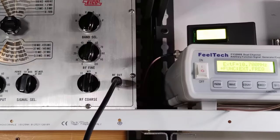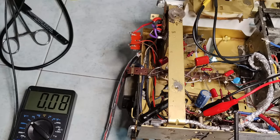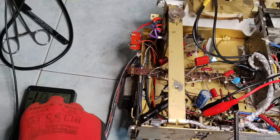However, in this case, the signal should be AM modulated, and that was obtained with an old signal generator, verifying the output frequency on the function generator, configured to operate like a frequency counter. The alignment was done seeking the equilibrium in voltages.